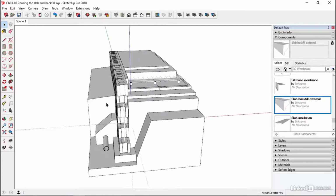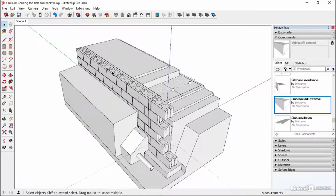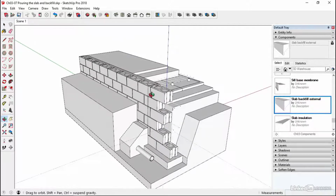We've got the timber sole plate to go on next, and that's going to come up to about here because the wall doesn't go all the way along. We've got a door coming in here as well with windows above. So we'll put that on next, and we'll show you how the little timber bolts anchor into this concrete, and then we can start building up our walls.